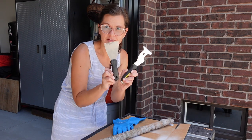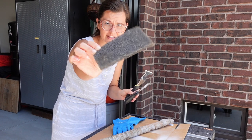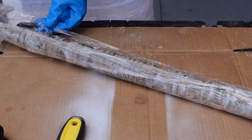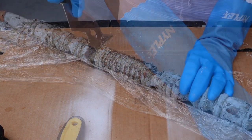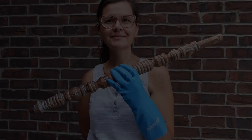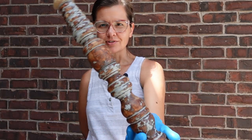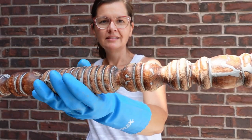It's finally time to strip the paint off these legs. I have a couple of tools: two different scrapers and one of these heavy duty scouring pads — they're meant for paint, not a thing from the kitchen. This is the first pass on the first leg. There's still paint left on it, so I think I'm going to have to give it one more application of the citrus strip. It's mostly in little grooves. Three more legs to go and then do it all over again.